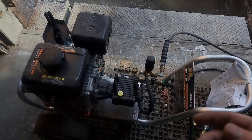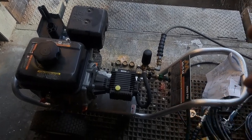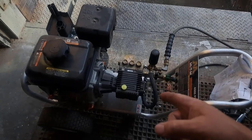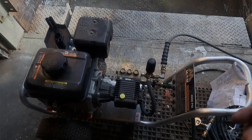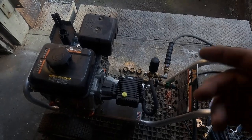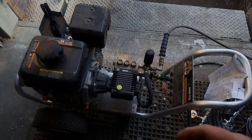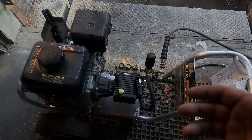You can see the pressure now — we're sitting on the white tip at about 3,300 out of a 4,000 PSI unit, which is where you want it. The smaller the degree tip, down to a zero-degree tip, the closer it stays to the maximum PSI for the pump. This is a 4,000 PSI pump. With a zero-degree tip, you'll drop down to about 3,800. It incrementally drops in pressure as you increase the tip degree because your orifice opens up and you're getting more water. The more water flow, the machine can sometimes struggle to keep up.